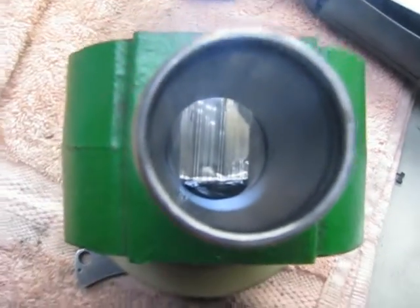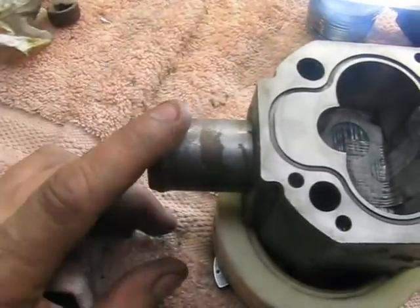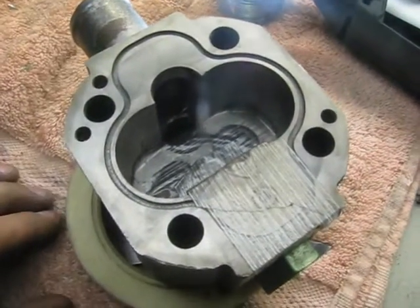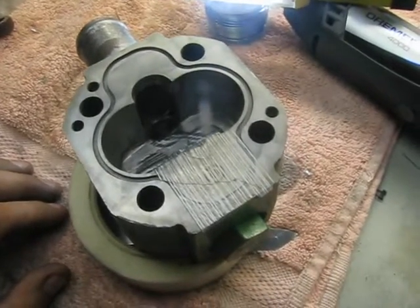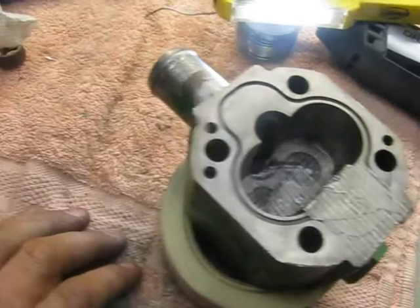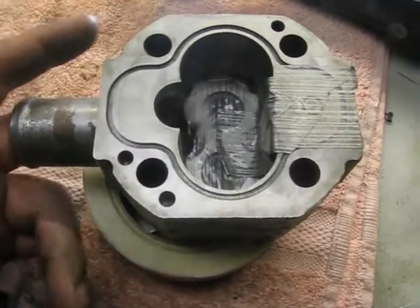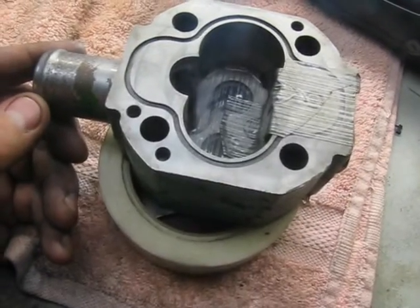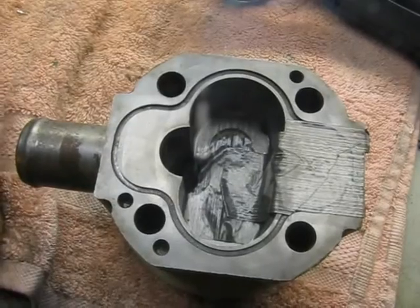The opening is much more relieved than it was before. Reviewing one of my earlier YouTube videos, I did happen to notice that this pump was crying as if it was sucking air right from day one. I thought it was the motor itself — the big Wisconsin engine — being the source of the whine. But now that I look back and think about it, this pump was actually sucking air right from the get-go. Why Haldex sent it out the door with a broken bolt is beyond me. Why they can't do the extra machining and clean up that port — well, that's easy: they're trying to make it as cheaply as possible and still have it be functional. But when you're trying to move 28 gallons a minute, that's a tremendous amount of fluid flow, so having a smooth passage is going to be helpful.